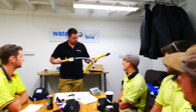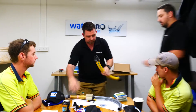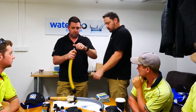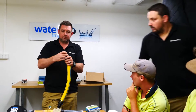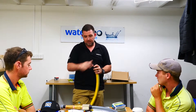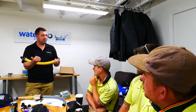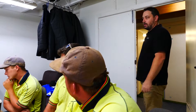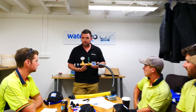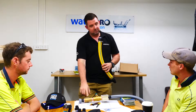Here's one we prepared earlier. That's an inlet pipe — that male thread will go into your fitting. So it's adaptable; you could put it onto different things. You can thread tape this onto a garden tap and screw it straight on. Our kit has enough fittings to adapt to either a 25mm ball valve or in-ground connections. The reason we've got yellow hose here and grey hose there is the yellow hose is mains pressure rated — so you can have this on a garden tap with the ball valve closed to read your static pressure and it's not going to blow apart.